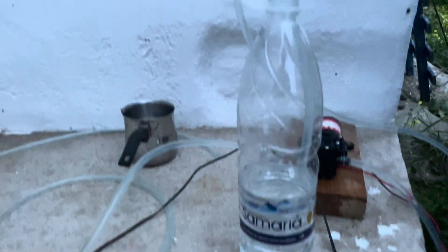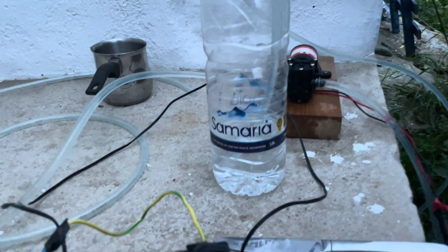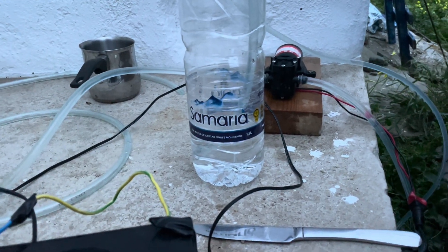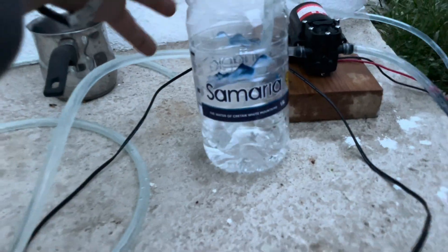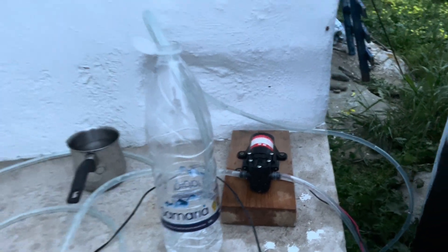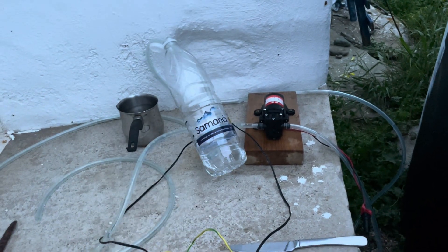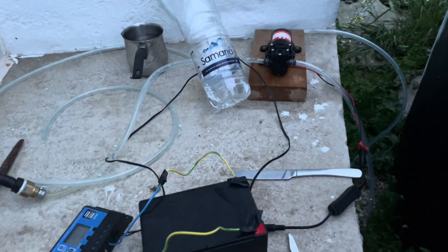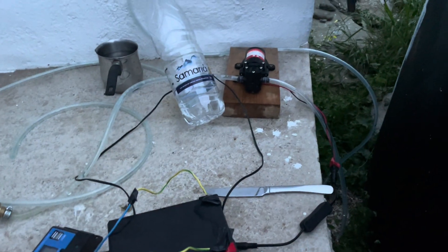Water's going somewhere — and there it is. It took about 35 seconds for one and a half liters. I did some math — it's going to take 24 minutes to fill the 70 liter tank up there. So 24 minutes is perfect, because this battery is more than enough to run this pump for a couple of hours.